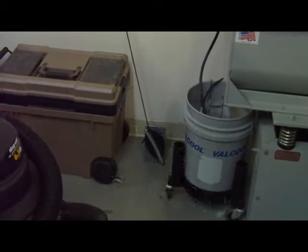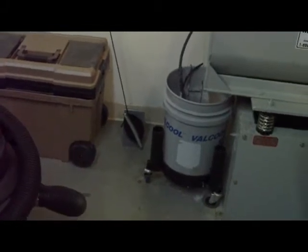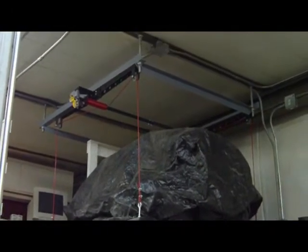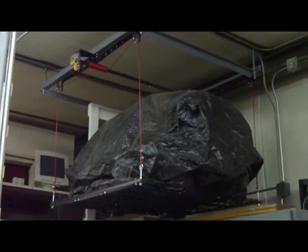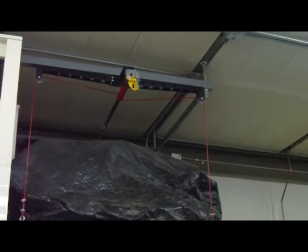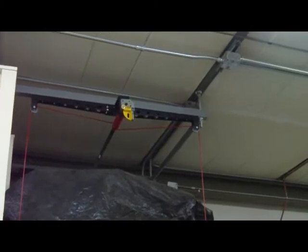This is how it gets lashed to the floor — it's a bit overkill: angle steel with about a 3/4-inch thick web, either six-by-six or eight-by-eight, which I just had lying around. There's also another ceiling storage unit from a hardware store — a platform with a steel frame I fabricated to attach it to the roof of a commercial building. I keep my racing lawnmower on it to get it off the floor, and the cabinet underneath is on wheels so you just roll it out of the way. The steel frame is held to the ceiling with 3/4-10 all-thread, which is admittedly overkill — half-13 or 5/16-18 would probably have been plenty strong enough.